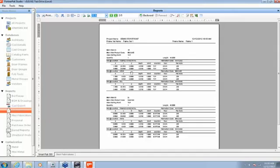If we look at the report here, you'll see our head is going to have holes drilled at, in this case, 1.8125 or 1 13/16, and that's from the head all the way down the horizontal, basically in the middle of the frame at 23 inches, and then the sill on a 48-inch stick is going to be fabbing down at 46, 47 inches, which will be at the bottom edge of the stick. It tells us about each of these fabs that we're going to have, where it is located off the back edge of the stick.